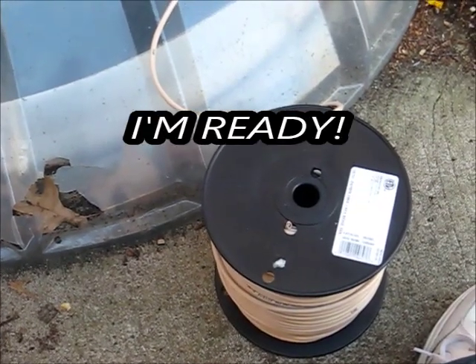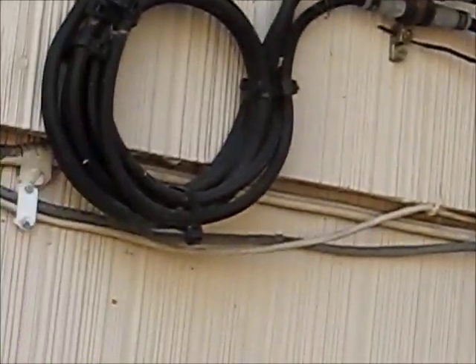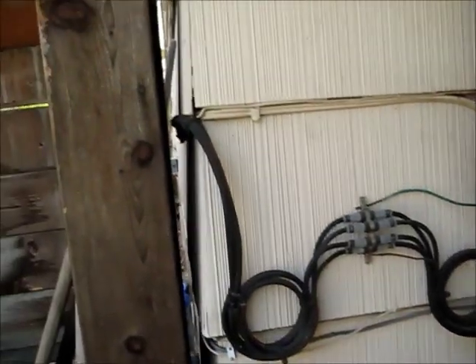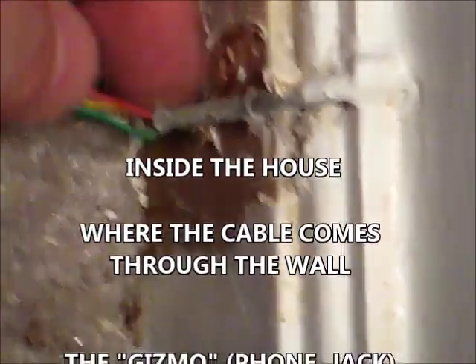When I'm ready I'll run this wire around. I've got my spool of wire and it goes up into the box — comes out of the box, tucked it in there, and I'm just going to follow those other wires around the house. What I did is I ran out the cable over to where I'm going to run it through the wall, because I had to tuck it behind that wire. I cut it to length so I could scoot it all behind there, and that's inside the house where I pulled that other gizmo off.